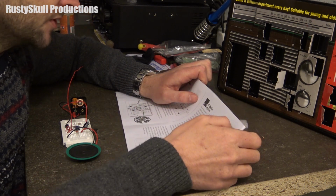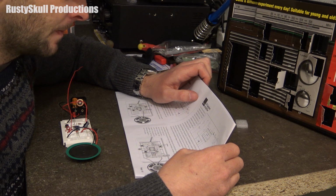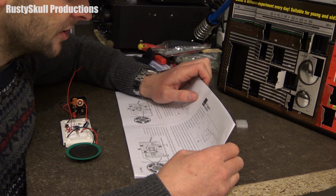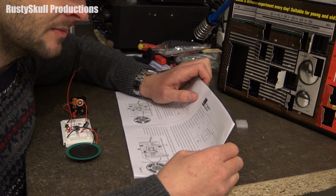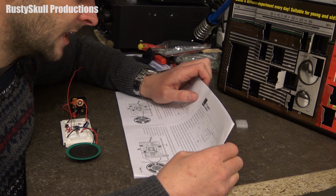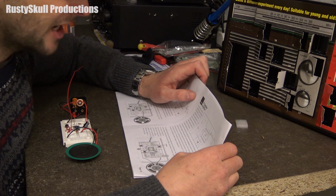Where are we? There we go. Press all connections on one side onto a hard surface at the same time, so they are bent to an angle of exactly 90 degrees. Then place the IC onto the breadboard as 8 connections are inserted at the same time. More force is required than for other parts. The IC must not be inserted the wrong way around. It is particularly important that the connections for the operating voltage are connected correctly. Pin 6 should be at the positive terminal and pin 7 at the negative terminal. Incorrectly connecting the battery voltage can destroy the IC.